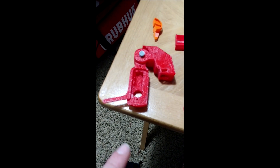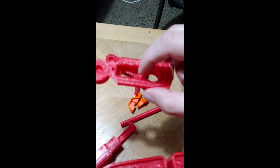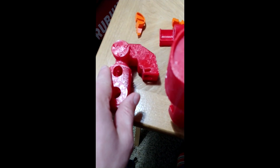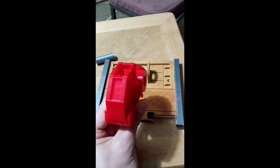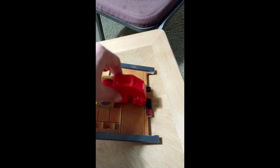When you're assembling this, make sure the servo pieces are pointed down and then you have the other neck piece just like that. There's a servo that gets bolted in right on this side and then it fits into this side as well. Put the first rod in there, put that one together, then set this one down on top — that will hold everything together with that rod in there. Then we'll come over here and put it down in the actual top mount of Wally, run the rod through.